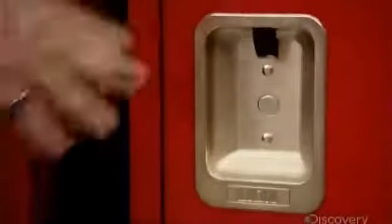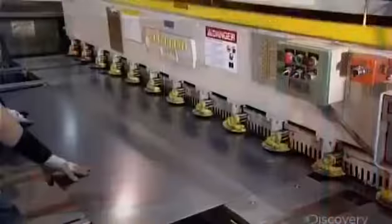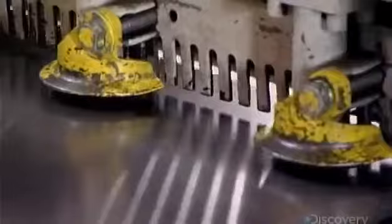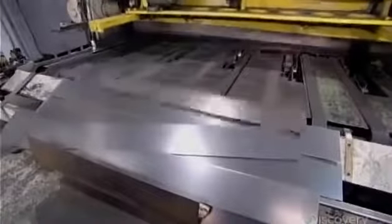Lockers are made of a hard type of steel that's just flexible enough for presses to bend to the required shape. The steel sheets are 2.5 millimeters thick. Workers feed one at a time through a cutting tool called a square shear, which slices from one end of the sheet to the other, cutting pieces with the required width.